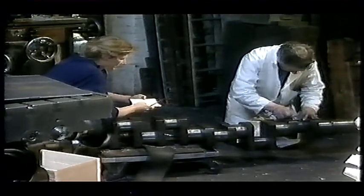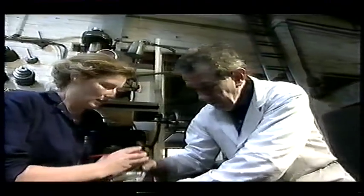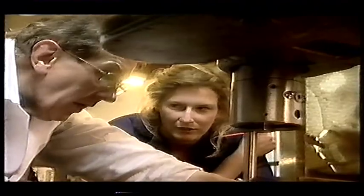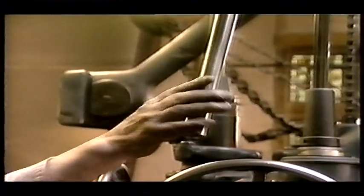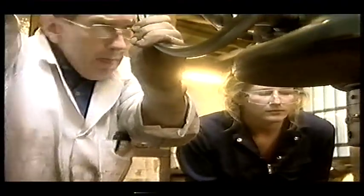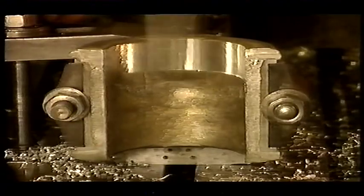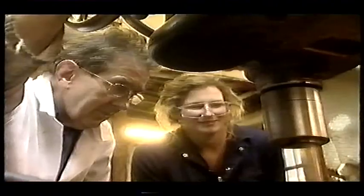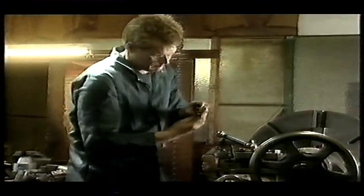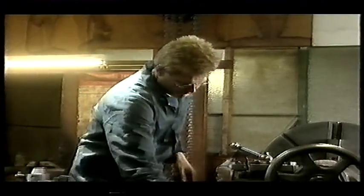We'll rig these up so we can start machining the excess metal — when we've trimmed that up it'll sit beautifully on the crankshaft. If we'd set the machine up even a thousandth of an inch out, our shiny new bearing would have become scrap in seconds. Whilst we were getting our bearings right, Jerry was about to get in a spin with the gate valve spindles.